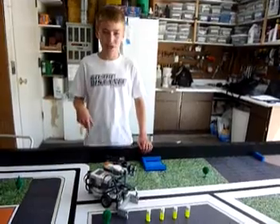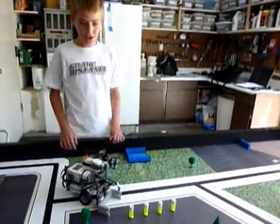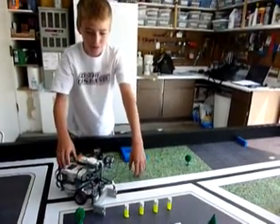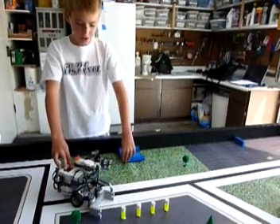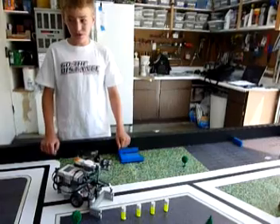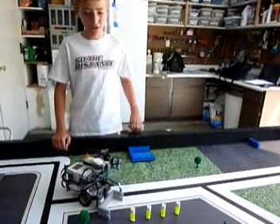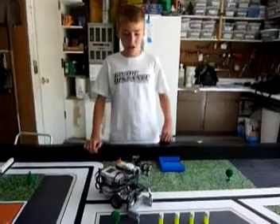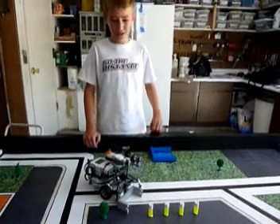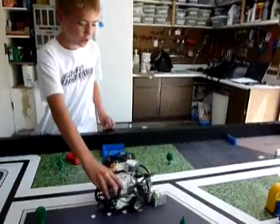Hi, I'm Kevin, and I will be talking about the gas mission. The robot moves four gas tanks to the post office. Because the gas tanks are in a straight line on the playing field, our U-shaped attachment on the front of the robot can sweep up all four at a time. Since it has corners, they don't slip out — if it had rounded edges, they would slide out of the attachment, and we would not only fail to get them to the post office, but also create new obstacles for ourselves. To reach the post office without a penalty, the robot must avoid hitting all the trees and boxes. We programmed the robot to move around the obstacles using the road, getting off the road for a tiny portion and coming back.